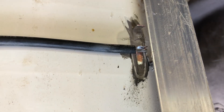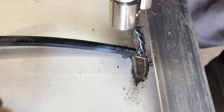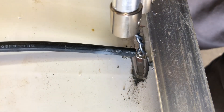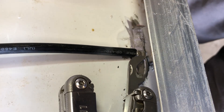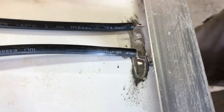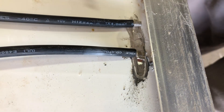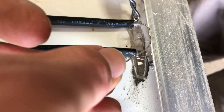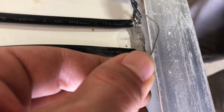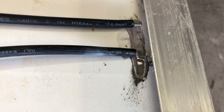I've seen some other videos where they cut the bus bars at the top of the panel instead of at the bottom, putting the panel into thirds instead of in half. The great thing about doing it that way is the max voltage — the VOC — would be 15. You don't even need a charge controller, as your panel really won't be able to overcharge the battery unless it's super cold out or the batteries are topped off when the VOC climbs due to temperature drop. The disadvantage with that method though is the max power voltage is about 12, and that's max power in ideal conditions. When it's hot out max power is even lower, and once the battery is at nominal voltage the current into the battery will taper off quickly as it charges, so you won't get much out of the solar panel. That's the trade-off.